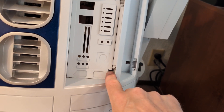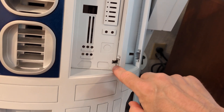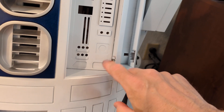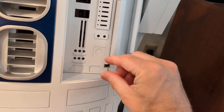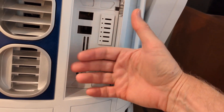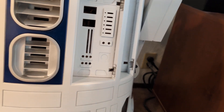For those hinge pieces I printed the Jason Charlton modified spring pieces, which are made for a traditional metal actuator that goes back to the servo, as opposed to the Michael Badley ones where you stuff a printed piece of TPU into the side of the hinge to activate it. People are getting better results using a traditional metal rod, so Jason Charlton took the original hinges, made them a bit thicker, added a hole for the metal actuator, and changed the angle so they close fully — since some people have problems with doors not closing all the way. I went ahead and printed his even though I had the original ones, since they use a TPU linkage that a lot of people have issues with.